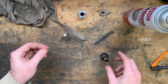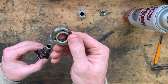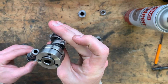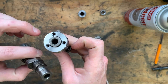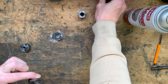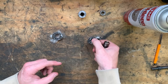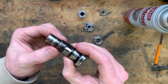...16003 bearing, press it onto here, and then shut this one back on afterwards. I've got this spare camshaft as reference so I can line the lobes up correctly. At top dead center, line up this hole here. We'll see how accurate I can get that, then chuck on our spacer and do a dummy fit up of our cam sprocket and chain. I might give this a little bit of a wire buff first.